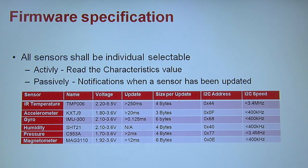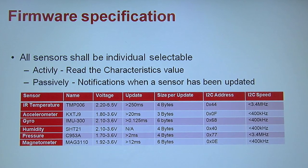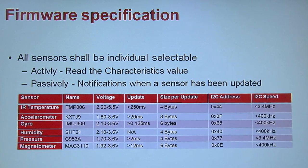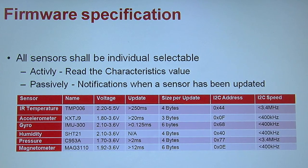In addition to the main design, we put in an additional interface to connect to other TI devices, though that is not required. Here you can see all the sensors added to the Sensor Tag — all six different sensors. The key point is to follow the IC manufacturer's design guidelines, so we followed what the sensor manufacturer specified in order to have optimal sensor performance.